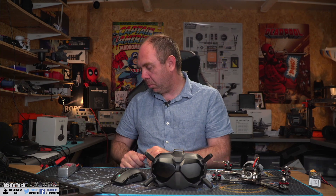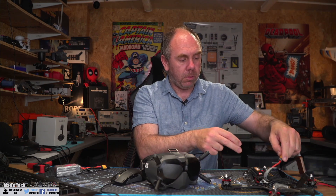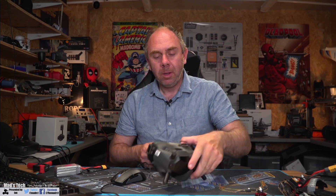Now let me show you how this actually works. I'm going to connect my goggles, power them up, and power on my DJI FPV drone. I do have props on this — I'm feeling a little dangerous today — however, remember you should always have props off when doing bench testing. It's also worth noting you should have low power mode turned off to actually get it to work, as that can affect the output especially when using it with the Caddx Vista.